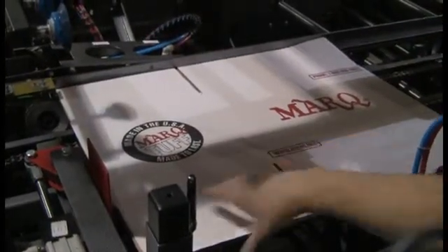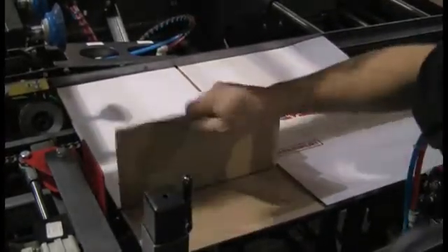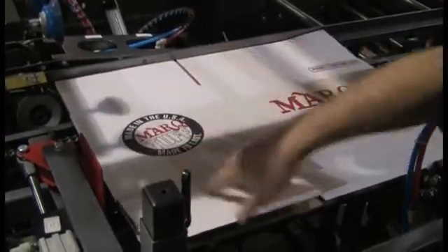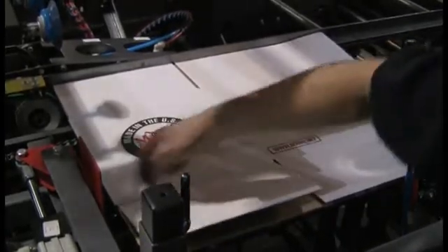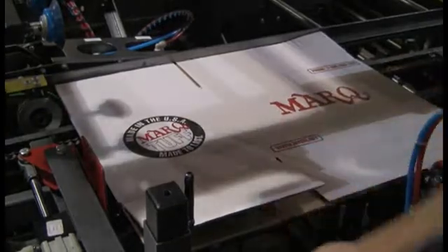We'll put this in there and now we'll be looking at the center channel. We'll take that long rail and move it out until this score line is along the outside of that center channel.